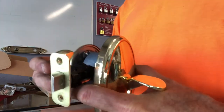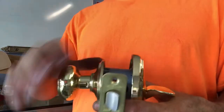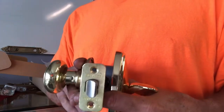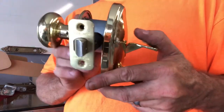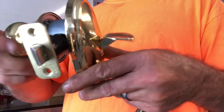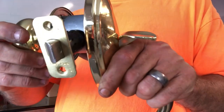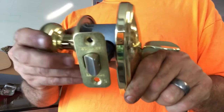I believe that's recessed a little bit deeper than it was before the redesign. But when the knob is out here, watch. So it's independent, right? Independent acting. However, if you're using it on a thinner door and you tighten it down all the way, look at that. It does react, but it does not make that turn when it's narrow. So if you are using this on a thinner door, you will get some action on the outside thumb turn when you turn it. But that really is only on a super thin door, because if you back it off just a little bit, it doesn't react then.